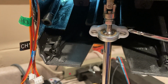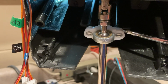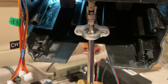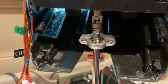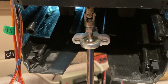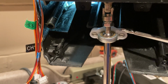And then I drilled these holes bigger in this ball bracket right here, to accommodate the new diameter of the screw. So now, actually, this is more solid than it was when it came from the original factory. It should now withstand everyday use, but that's not what took it out. What took it out was shipping, where they get banged around much more than they would ever probably get banged around in normal everyday use. So that was the fix for this broken joint here.